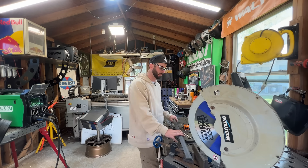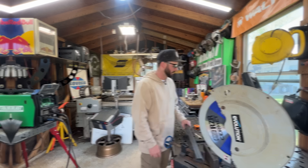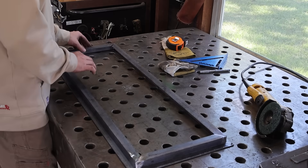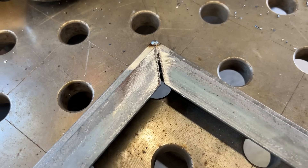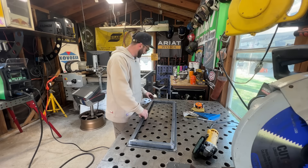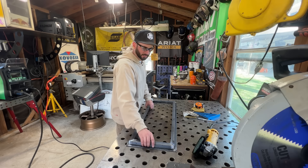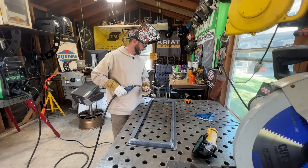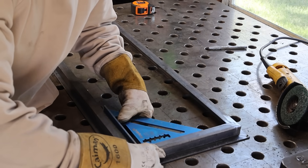That's how you end up doing it just a little bit quicker - instead of having to cut each piece to length and then cutting each miter. You just rinse and repeat on the prep. Everything's now going to fit on the inside of this. Looks like I got just a little bit of a gap all the way around - somewhere around a 3/32 inch gap - but that's okay. That's why I like working with metal and not wood, because I can fill that in. I'm not going to squeeze everything tight because I found that just makes things a little bit tighter than I really like.